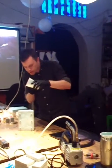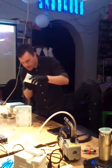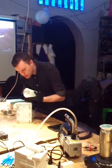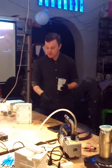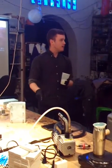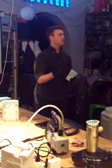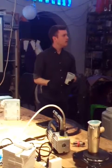That's pretty dang close. Since this doesn't have another wax side in it, it takes about twice the silicone. I mean, you degas it once the silicone is, oh, you don't do it once the silicone is set. While it's still liquid, you degas it, you put it back in the pot and degas it once more. But you have to do it quick because the silicone might set on you. It's a little bit like a souffle.